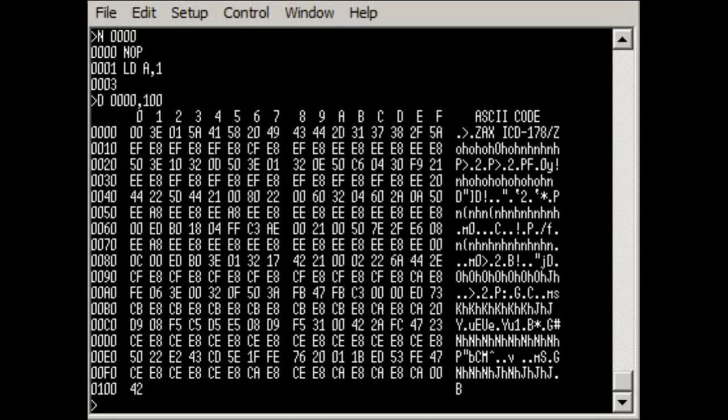For example, you could just replace a bit of code on a target system, maybe it's running CP/M and you want to do some testing on a floppy disk. You could replace the floppy disk code with some code that's residing in your user memory on the ICD. Change a single instruction or multiple instructions, carry out specific tests, and you can do that at full speed, which is one of the problems in using something like the Fluke 9010A. You can't run it at full speed, so trying to fault find on things like a floppy disk is slightly tricky. But using this system, you can run it at full speed, do proper data capture, and then disassemble the data, all from the comfort of your terminal.